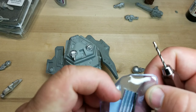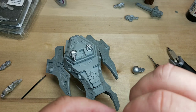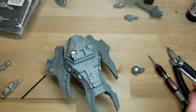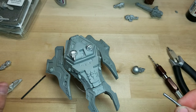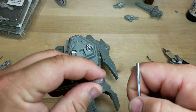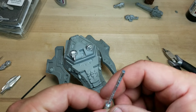I think this drill bit size is good for these really thick magnets — yep, that'll work. These are good rare earth magnets — they're super strong, the strongest I could possibly find. You also want to make sure — definitely make sure — that the polarities are correct for either side. This side fights, this side connects. So we know we want the top one face down and the bottom one face up.